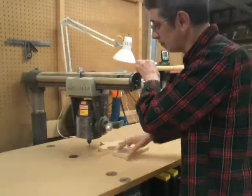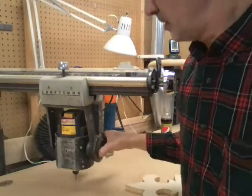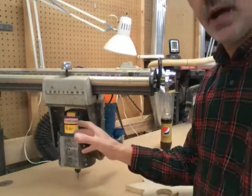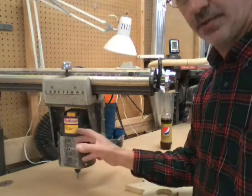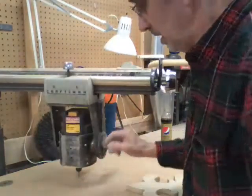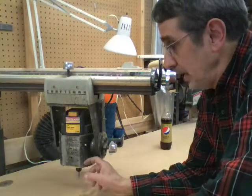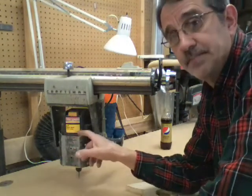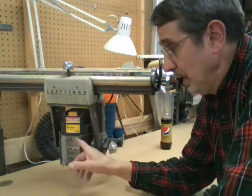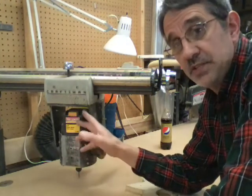What I did was strip the motor down to everything but the outer shell. I had to drill out some rivets to get out the field windings and the iron outer edge of the motor. Then I made a couple of wooden discs out of one-inch-thick ash that these screws go into, and I cut them to fit inside the housing. I stuck them on a lathe and bored a hole through them the size of the router base. I slit them and put a screw through them sideways to use as a clamp to pinch the router base, so you can take it out anytime you want.